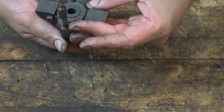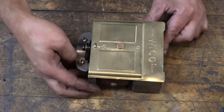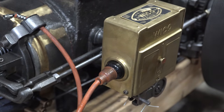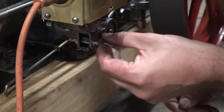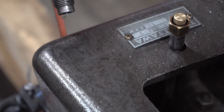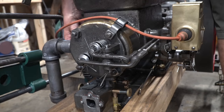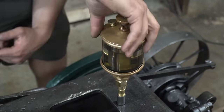Now I'm cleaning up the points on this side and the general outside, and now it meets well. It seems to magnetize nicely and that's all I really need to attach it to the actual engine block. You can see the 'stop' lettering there on the button. I also machined a new pin for the magneto — this is what latches onto the timing rocker that decides when this thing is going to spark or not. I'll give it a little shot of oil. The original one was just a bolt with threads, so that's not okay. And we have spark — we're in the zone. There's nothing else missing: we have fuel, we have spark, and we have an unnecessary amount of compression. Turning this over by hand is incredibly more difficult than when we started.